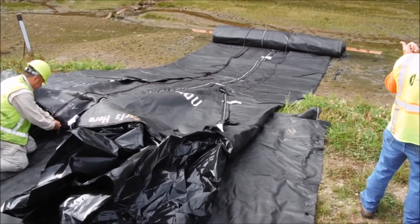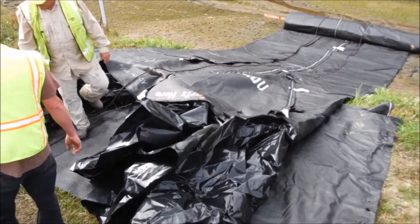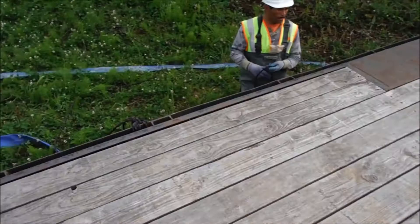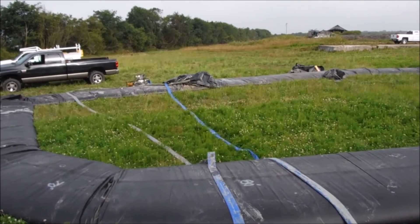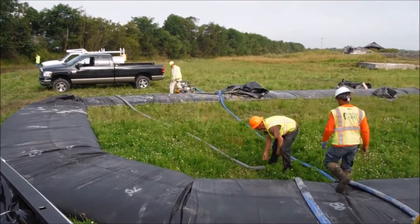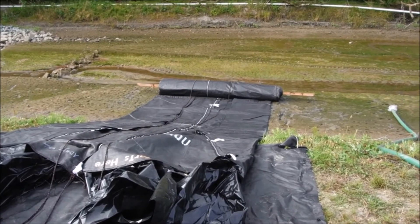The 8-foot tall aqua dam hose has been unrolled and pulled down the slope. It's right at the top of the lowermost channel in the middle. The fill tubes are being prepared by inserting one 3-inch discharge hose into each fill tube. The hoses have no fittings or metal pieces on the end which could damage the inside of the aqua dam. The blue hose on each side runs over to the pumps. The pumps are now pumping, putting water into the hoses and into the aqua dam — just a little bit at first until we get the pumps going, then we'll turn them on full bore.